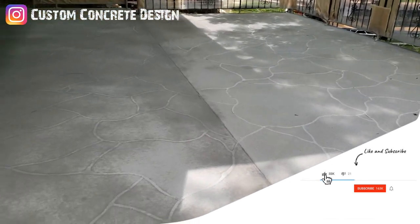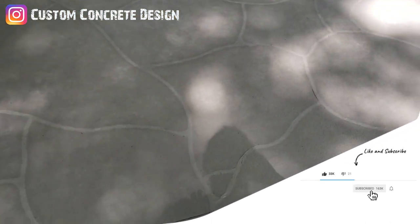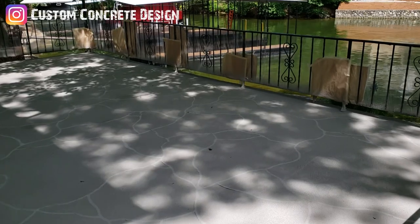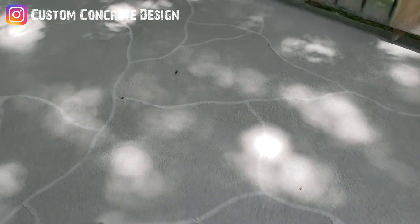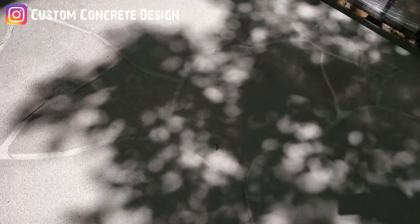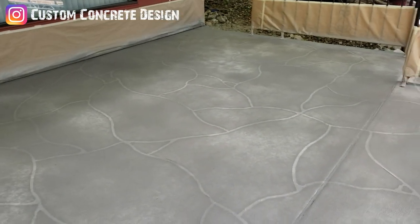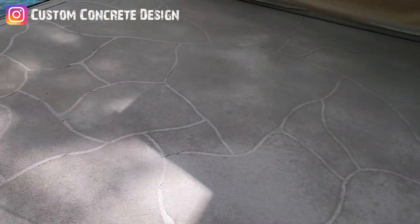We have our tack coat on. This left side over here is obviously still wet — that's why I ended here at my mixing station and stopped. That's why it's a little darker, and over there, as you can tell through the shadowing, it is dry and lighter. It's kind of crunchy because I sprayed it on, but it's locked that tape down. So now there's a thin layer over the top of it. The next coat is going to be our texture coat.